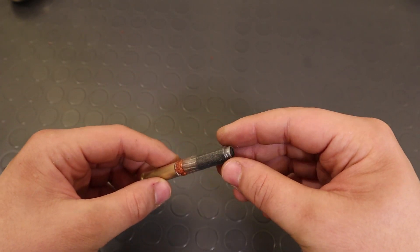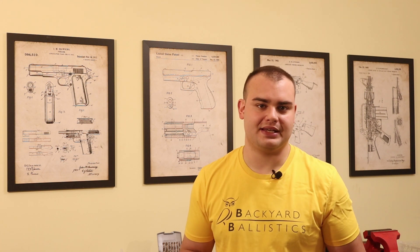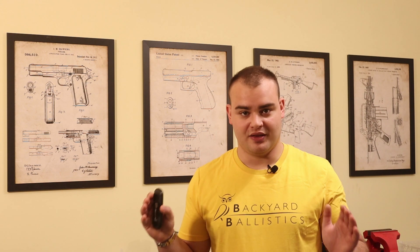The two sections are held together by the main projectile. The top part is pulled away together with the ballast, while the bottom one is thrown out of the barrel together with the gases. If it doesn't, it's not a big deal — this arm only requires a closed pipe to work, so it doesn't really matter if there's a little bit of junk at the bottom. To recap: when the precursor charge is ignited, it pushes at the same time both against the ballast and the main slug and charge. The ballast is thrown out of the muzzle, pulling the plastic sleeve with it. The main charge is instead thrown towards the breech, and in a matter of a few milliseconds it hits the bottom, where the impact triggers the primer, igniting the main charge. The pressure rises, the base of the slug expands, obturating the barrel, and the shot goes on as in any other gun.